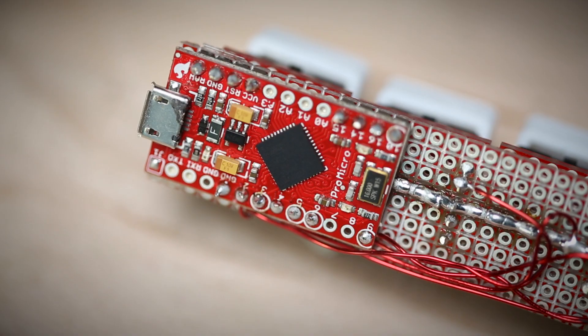My Keyer is able to enumerate itself as a USB keyboard because I'm using the SparkFun ProMicro, which has a native USB driver on board. So I was able to just make a few simple Arduino calls so that it would act as a keyboard. And when I plug it into my computer, it pops up just like any other keyboard that I plug in and works with all of my applications.